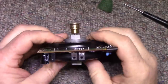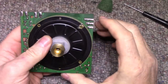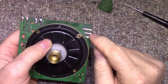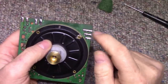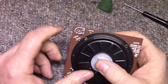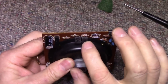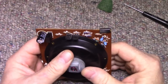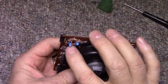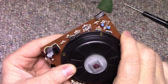If you're having trouble with this motor, for example, if it doesn't run at speed or if you're having speed problems, most likely your connections that go off board to the potentiometers that adjust are probably either an open circuit or a bad potentiometer or a dirty potentiometer, and that's probably what your problem is. Another problem could be this trim pot here, could be dirty or open. Pretty basic circuit. You can check two transistors here. If one of these is bad, maybe that might be the cause, but I doubt it. Probably the motor wouldn't run at all. Two tantalum capacitors. These can short circuit, but that's rare. And then of course your resistors, they can fail too on the off chance.